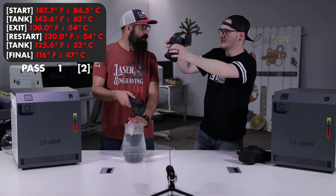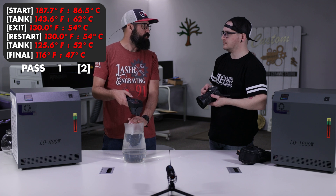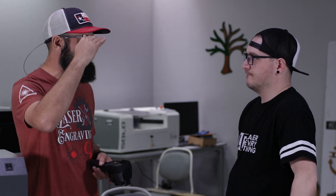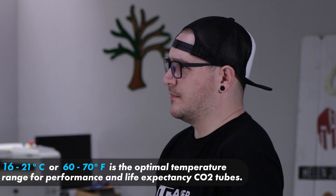So we basically dropped the temperature within seconds by half. If we would have kept cycling this longer at that rate, it's dropping the temperature real fast. Just a couple of cycles through — within literally under two minutes it's already down to 117. Moving through those coils reduced the temperature by about 70 degrees Fahrenheit, and then once it had exited it had already dropped another 20 degrees. What Marco was saying is these constantly recirculate the water, so minute by minute it's getting down to basically room temperature — what laser tubes like to work at, about 60–70 degrees. I keep mine at about 17 Celsius.